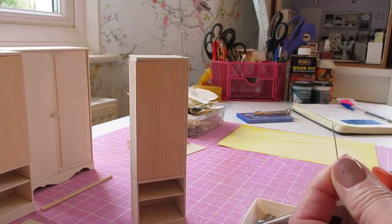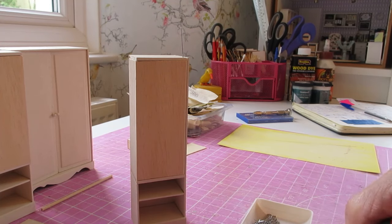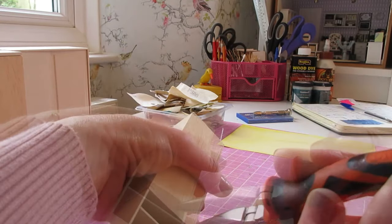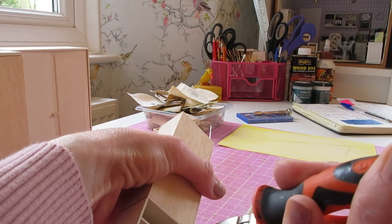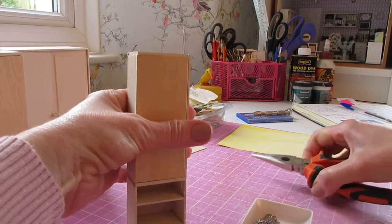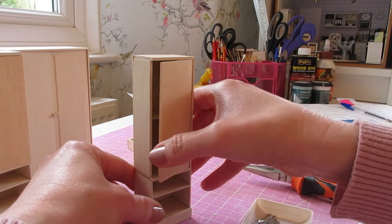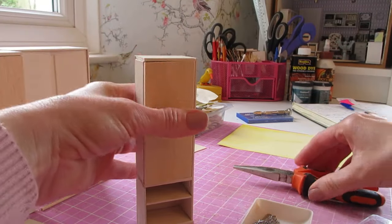At the bottom you'll need to cut one of your pins so you can get it into the drawer opening. Just trim that and work it into the bottom of the door — just enough to make that little pin mark, pushing it up with the pliers. Then open the door to make sure you've got a nice smooth opening door. I'm happy with that, so I can now go ahead and drill the holes.